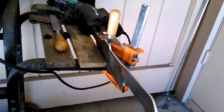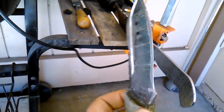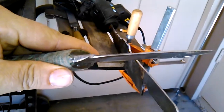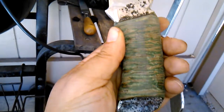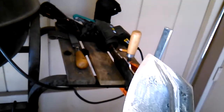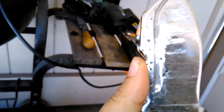My file went to hell because of this spring steel knife I made — it's still too beefy so I'm taking some meat off it. The edge from the Work Sharp is great — I've been chopping wood with it. But the file wore out on me. It's so hard to work because I didn't temper it; I've been working it all cold. Everything is very slow and tedious but it's turning out pretty good. Got my thumb slots here for a good grip.